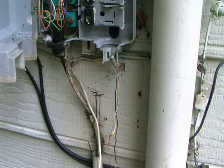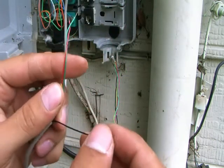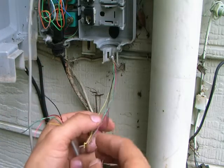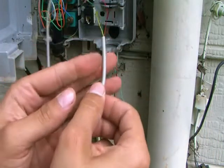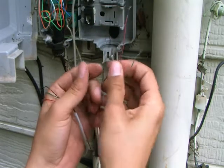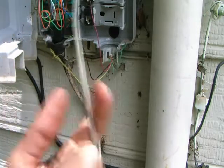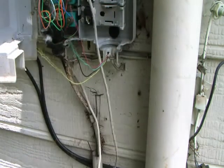What you're going to need to do is take that long cord from the Vonage that you have upstairs and split it open. When you split it open, you're going to notice that you have four wires — yellow, green, black, and red. The colors may vary, but all you have to do is just match them up. So what I did is split apart the Vonage phone cord that is upstairs and also split apart the phone cord for the house that basically used to plug in here to give service to the entire house. You'd want to verify before doing any of this that you are connecting to the right phone cord, because you don't know where all these cords are — it took me a while to find them.